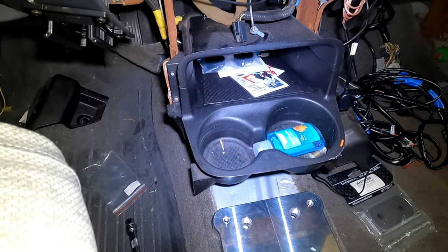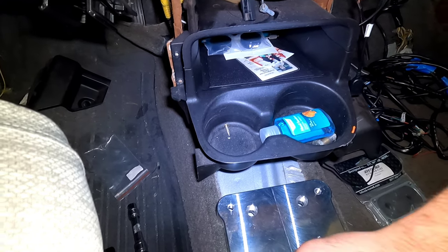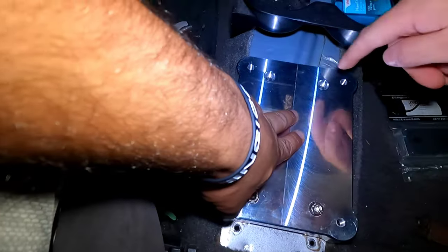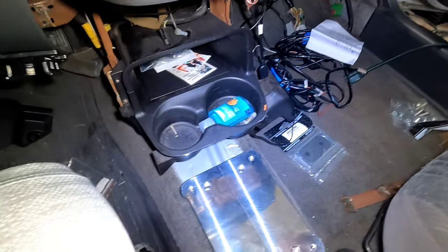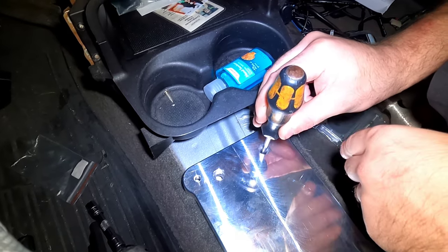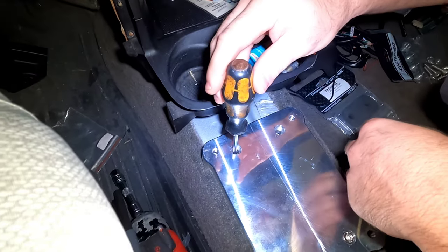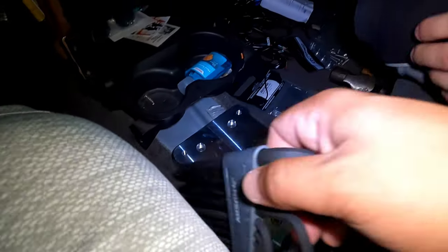I'm not going to drill the holes while it's on — I'm going to take it back off to drill the holes, but I'm just mocking it up to make sure both screws line up, and they do. Now we can stick a sharpie down through there and mark where we're going to drill. Actually, something better than the sharpie — we got a little punch. I'll stick that down in there, try to get it in the center, and give it a tap. There's a good dent there at the very least — a nice little mark down there.